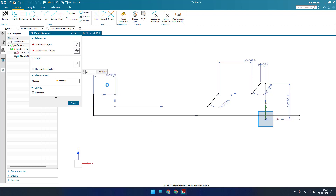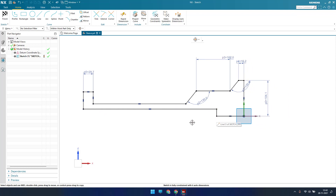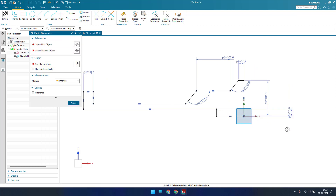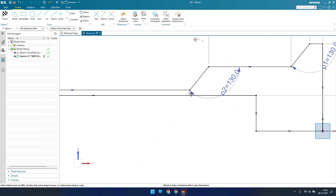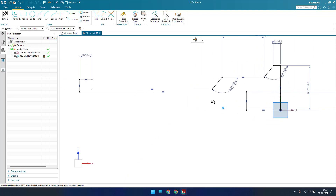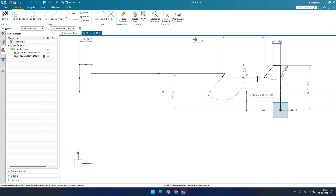This dimension is 29.70, and let me place this dimension here. Whatever is between this and the X-axis it is 85 divided by 2. The dimension for this is 170 divided by 2, and this is also 170 divided by 2. We are left with only this dimension — let me check: it is 187 divided by 2. Go to Dimension and set this to 187 divided by 2.